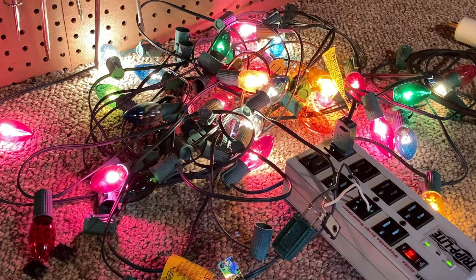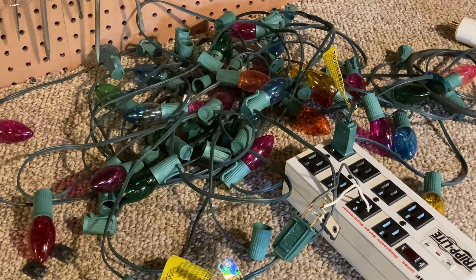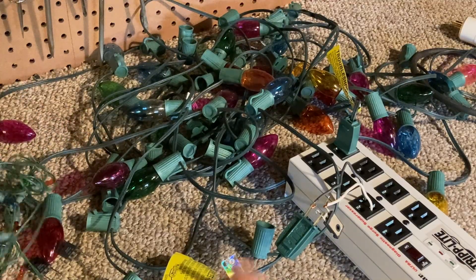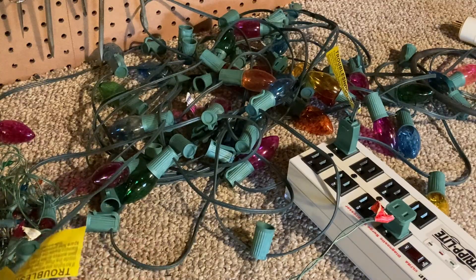You could use twice as many lights outside with this approach. Where this will be a problem is LEDs — I know you have a couple of LED strings and those would look really crappy with a diode in series. The flickering would just be twice as bad — or it would either make no difference or it'd be twice as bad. But LEDs use so little energy anyway, so you can easily divide up the connection to separate the LEDs.